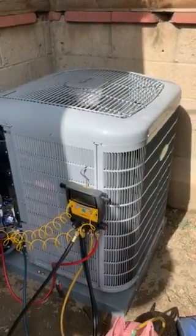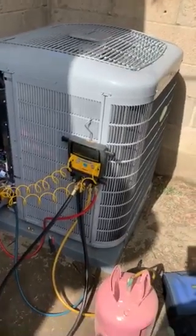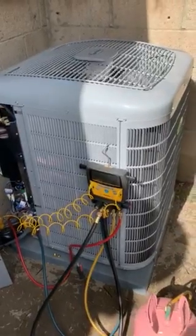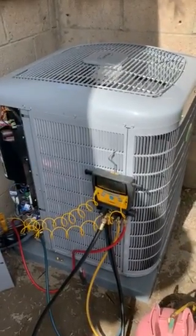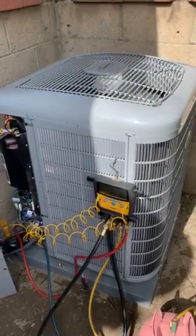This unit size is 31 by 31 on the base by 36 inches high. It uses Puron refrigerant. It has a variable speed inverter compressor and it's just fantastic for cooling because it has all those different speeds, so it keeps your house very, very comfortable.